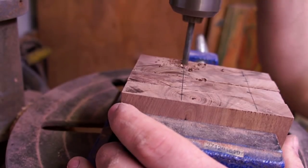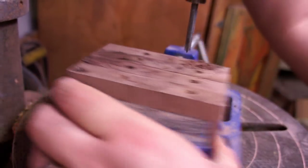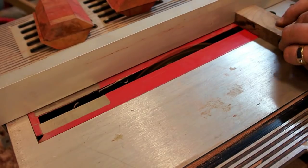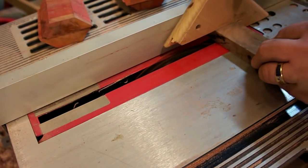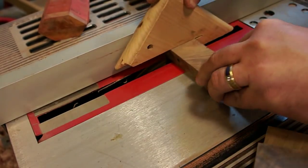Here I'm just going through and marking where all the holes needed to be. I drill them all out in these walnut pieces first on the drill press because I want these to be perfectly perpendicular to the wood. And then you'll see how I come back later and do them on the red heart pieces.